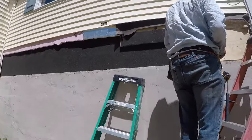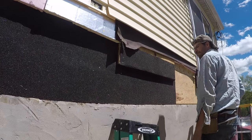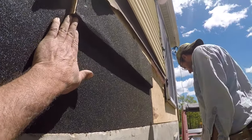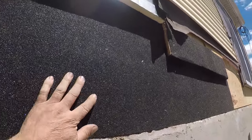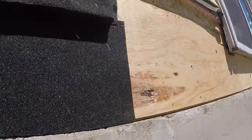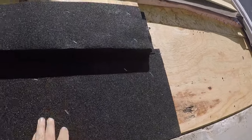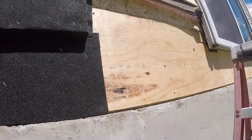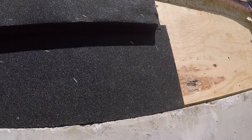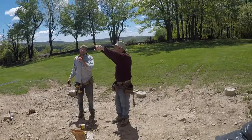Now it's time for tacking up some ice and water shield. What is this stuff, Connor? It's really good tar paper with a granular surface and a sticky backing. It actually sticks right to the plywood, and you can drive a nail through and it seals around it. It sticks like crazy — it's going to stick and get gooey, so every nail we penetrate through this to hang a deck is going to get sealed by this ice and water shield. If we strike a line across there, we cut that and stick it on.